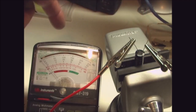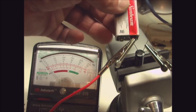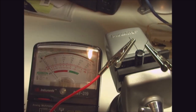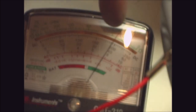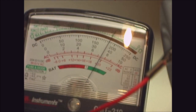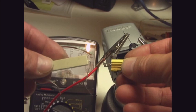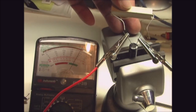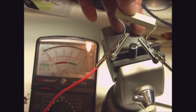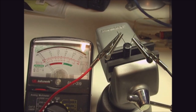I've set up a capacitor and an analog multimeter to demonstrate what it would look like if the camera capacitor did have a charge in it. I'm going to charge this capacitor with a 9 volt battery, and you can see the needle climb as it charges. Now you can see that the needle is slowly going down as the capacitor discharges — this could take several minutes. If you want to quickly discharge the capacitor, you can use one of these large resistors found in an electronics store such as Radio Shack. When I touch the resistor to the capacitor, you'll see the needle quickly drop. You do not want to just connect a wire between the two leads on the capacitor, as this could cause damage. It's also possible to discharge the capacitor using a light bulb or a small motor.